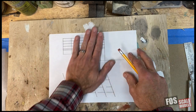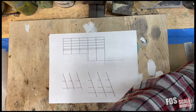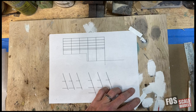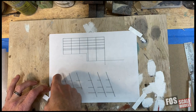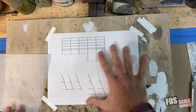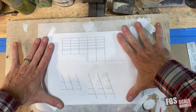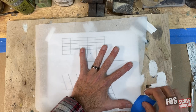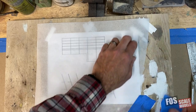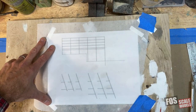With any kind of template, you want a nice flat surface — this is just some birch plywood that I work on a lot — and you want to tape it down because we're going to build the framework right off the template. Keep this pretty flat; I don't want any bumps. Once we have this taped down, we're going to put down some wax paper or parchment paper. This is transparent so we can see through it, and you want to rub this tape down pretty good. It's a nonstick surface, which is what we want, but you want your tape to stick, so be gentle with it.